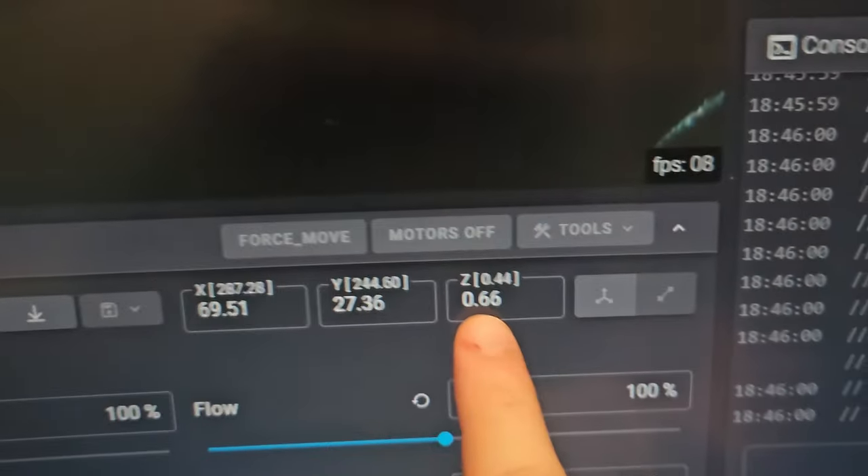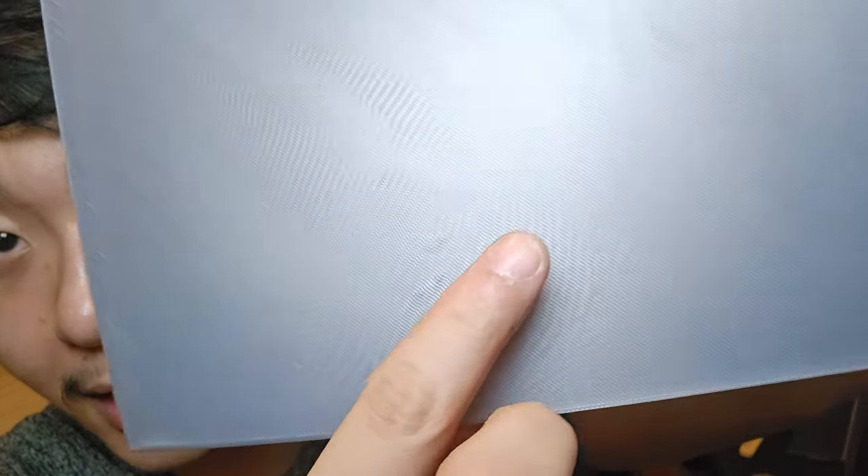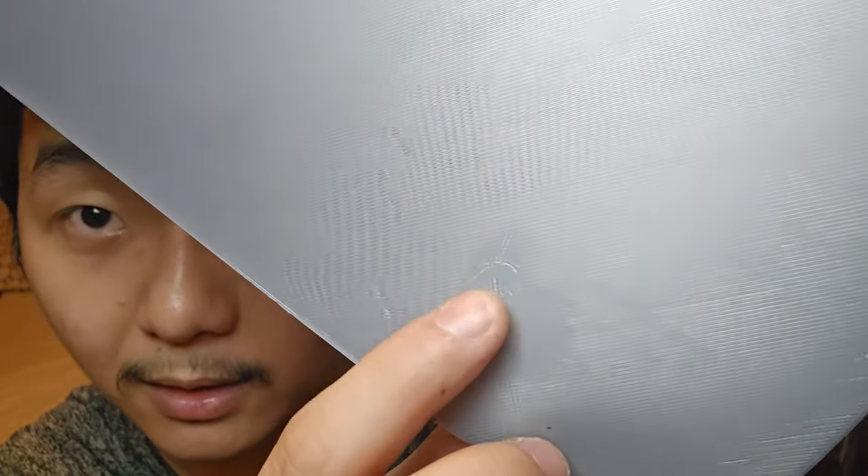The bed goes down according to the mesh it probed, and it did it perfectly. The only defect is some diagonal lines in the print — I'm not sure exactly why it printed that way, but it's not that bad. There's also a defect on the plate itself: I was printing with PP using packaging tape, tried to remove the tape with a blowtorch like an idiot, and the adhesive embedded into my A-plate bed — that's why I see those marks.